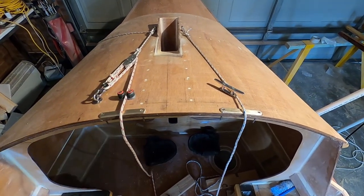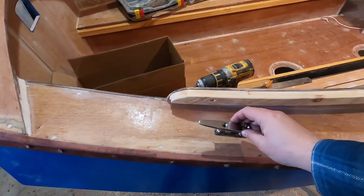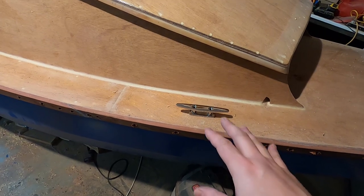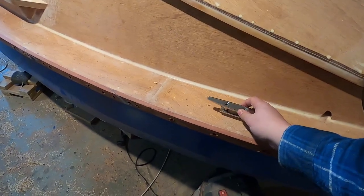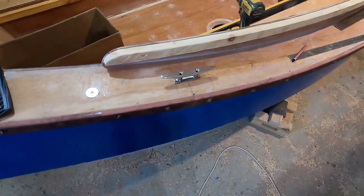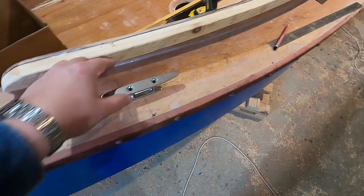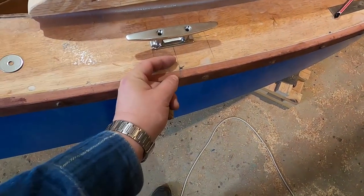That's it with the hardware up here on the cabin top for now — pretty good. I've got four mooring cleats that need to be mounted and they go approximately here and on the other side, and also here and on the other side. There are backing blocks already put in underneath this area to give these a strong mounting point. I don't want the cleat too close to this edge as it'd be a pain to get the mooring line around, and not too close to the outer edge either since there's overhang there.